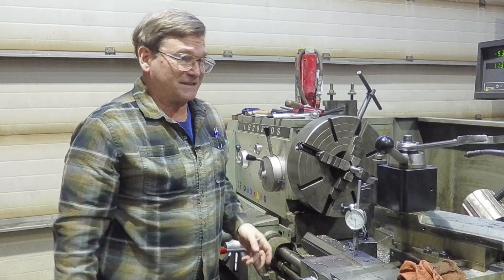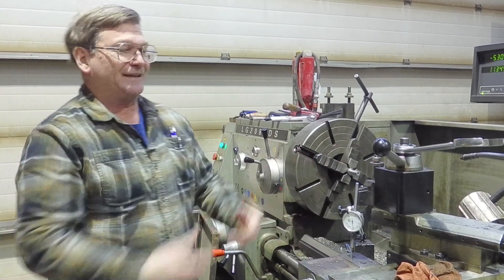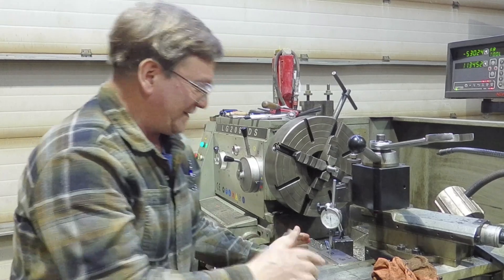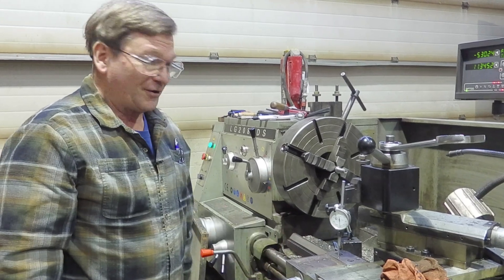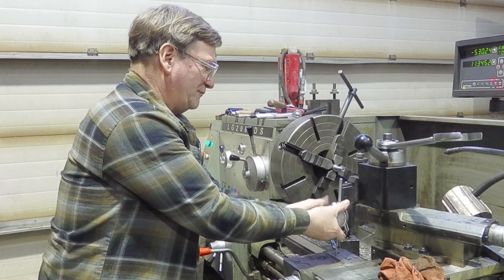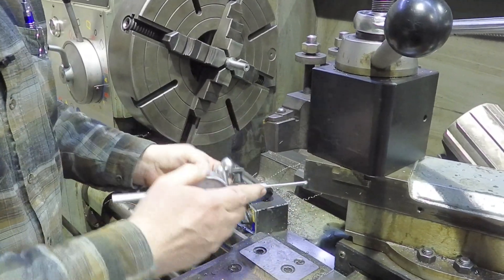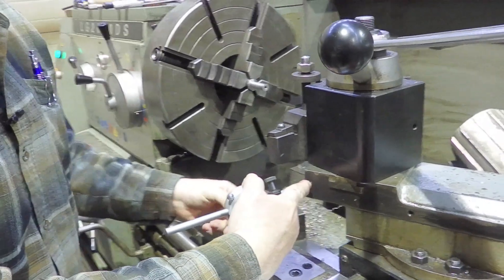I got thinking this should be discussed after seeing a comment where someone asked what's wrong with leaning on the carriage — the answer is it's going to move things. I probably can't easily move this one by hand right now, especially not in the up-down axis without a bar, but it will move. We just tightened these gibs so they're going to be pretty tight.